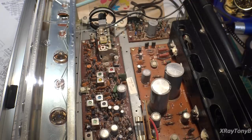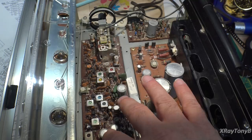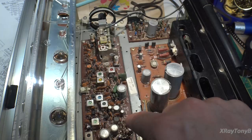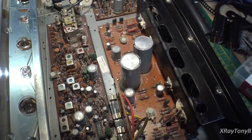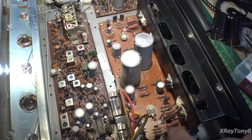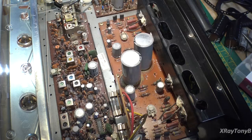This thing has what I would call capacitor blight — when you have chronic failure of every capacitor. This one is really swelled up badly. This one is a little bit swollen. This one is swollen, puffing, and leaking. They're all just bad — they need replaced. I did a little spot check, setting my meter on ohms only. Being that this resistor is toasted, I checked these transistors and sure enough, I have a collector-to-emitter dead short on this transistor. The other three seem to be okay, but usually when one of them gets stressed out, you don't know what the other one's going to do.